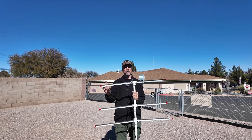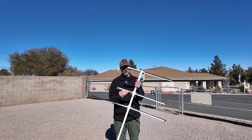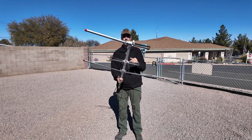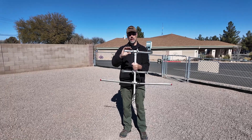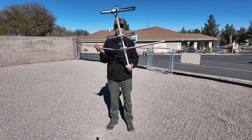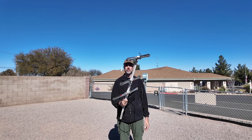As I get closer and closer, I can fold these guys in to attenuate the signal by having a not-so-good antenna, and I can fold them in in any way that makes sense and helps. Another cool thing about having this be a tape measure is that if I hit something as I'm walking through, the elements just go out of the way — I don't have to worry about them. And it folds up nicely for storage into tiny little pieces.